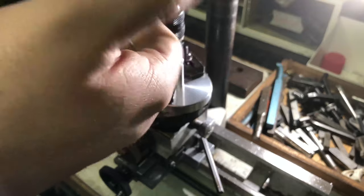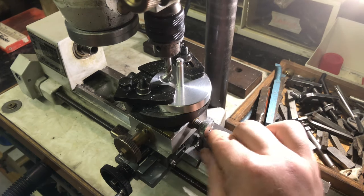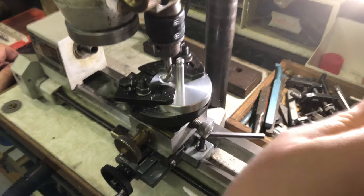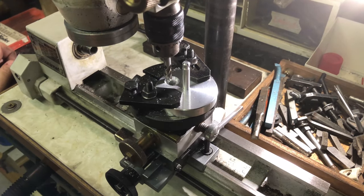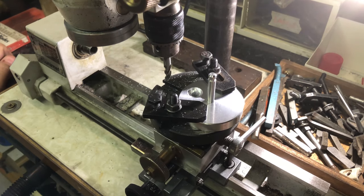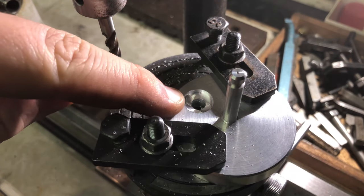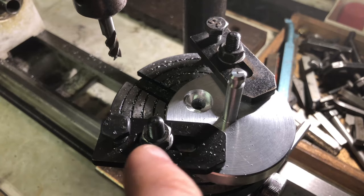Right, let's retract the bit all the way — that makes sure it clears. Then, first of all, let's clean off the ways. Don't want aluminium getting all in the V of the ways — the one problem with it being a lathe and a mill, well, it does both. So, you can see the hole better now guys. As you can see, nice flat edges on it, which will be perfect now for the bolt that needs to go in there.